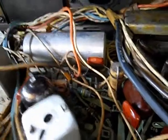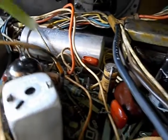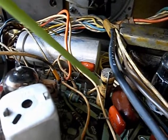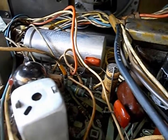We're back to work on this capacitor — this is the last one I want to take a look at. This cap right here is responsible for filtering the negative bias voltage that's tapped off the horizontal output.